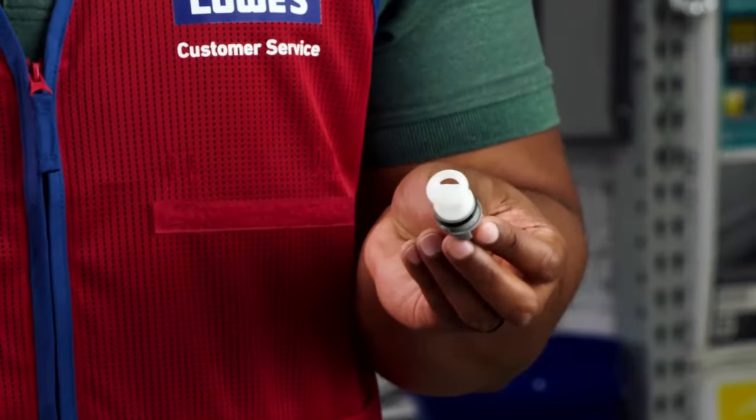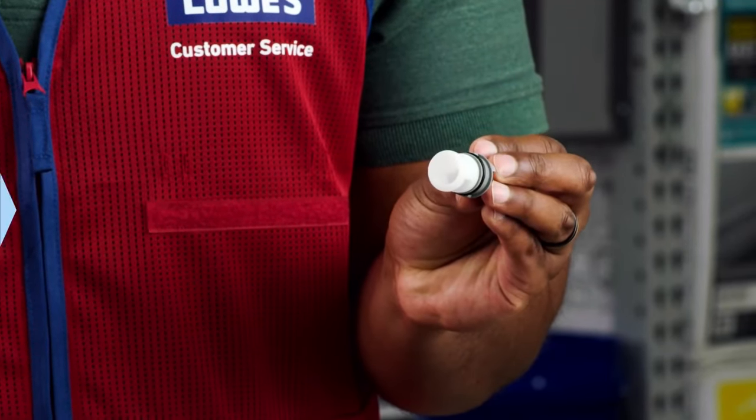If you replace your cartridge and now the hot and cold are reversed, the cartridge is most likely set backwards. Disassemble the faucet and turn the cartridge 180 degrees.